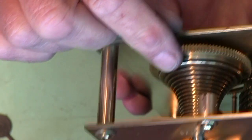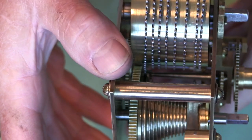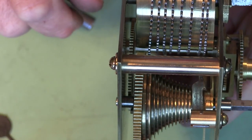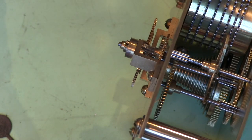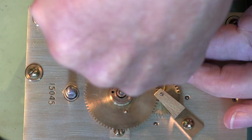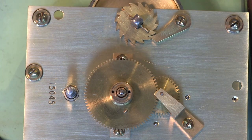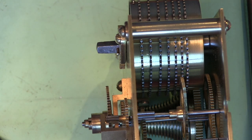If we look at the bottom — it's going to be a bit hard to see with this camera angle — you can see there that the chain now is pretty parallel. It won't go much further. Then what you do is just put some power on it — about a quarter of a turn, between a quarter and a half of a click. That will just finish it off and keep everything under tension. Then very importantly, make sure that the click is screwed down nice and tight. Now there's always tension on there and it won't fall to bits. So now you can wind it.